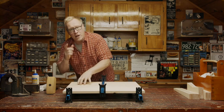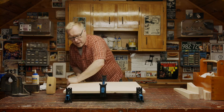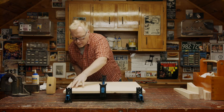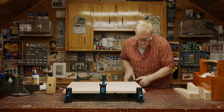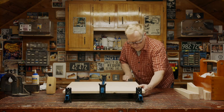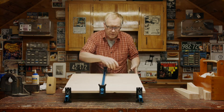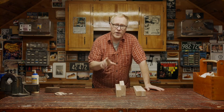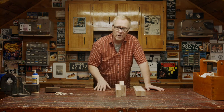If you can't get the side ones flush, you can always use a C-clamp to clamp them together. Push them down — I want to make sure they're level on our clamps. That's what we're looking for — just enough squeeze out. You don't need a ton of pressure, just making sure that board's flush. That looks perfect. Just going to put this aside and go ahead and glue in our biscuits. We have our tabletop glued up. Now I'm going to glue biscuits into the ends of the aprons — I don't need to put any into the legs. Once those biscuits have dried, we'll glue up the table base.